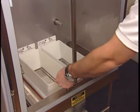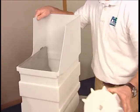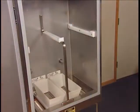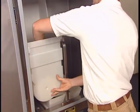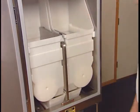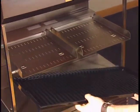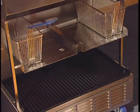Then set the accumulator housings into place. Next, install the fry diverters in the hoppers by sliding them into the slot located on the inside hopper walls. The square opening in the drum should point to the rear of the hopper. Install the hopper assemblies into the cabinet by sliding them onto the hopper supports, being careful not to force it. Rotate the drum until the square opening meshes with the drum motor shaft, then slide the hopper assembly back until it drops into place. Line up the two holes of each basket guide with the two locator pins and snap the guide down. The drip tray slides in below the basket guides, and you can then set the fry baskets on the basket guides.